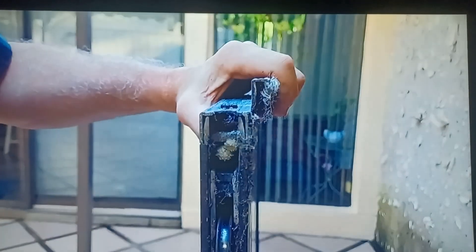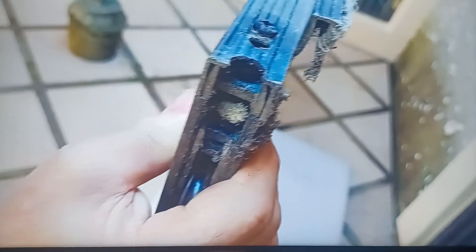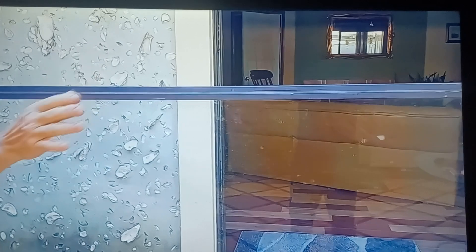They sell the complete roller assembly — I'll show you a view after I get it out. I'll clean this all up and oil it. There were black widow spider eggs in there. You take those out, and then this whole bar running across here — you have to lift it. There are two screws to remove. Then you take the entire piece up, and there's a gasket. Working with glass, you shouldn't do it alone — have somebody there just in case.